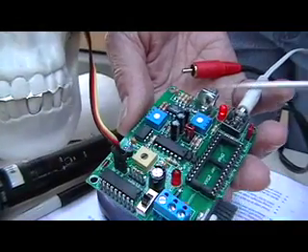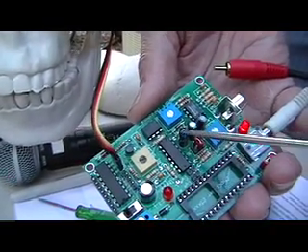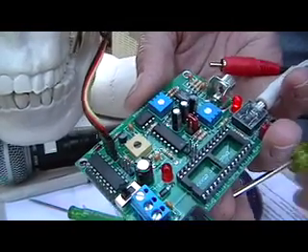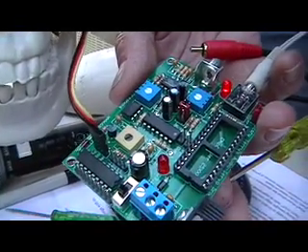The other adjustments you have on the board — you've got three capacitors here: a 10 microfarad, a 4.7, and a 2.2. Those adjust how quickly the servo will respond to sound. On the 10 microfarad, it's very slow and sluggish but with a very smooth action.